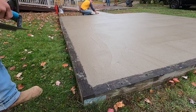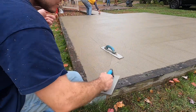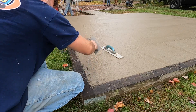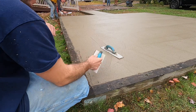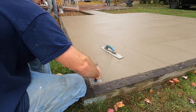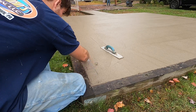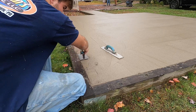Start with the hard part, the corner. If you ever have stuff on your edges, cut it away — it's going to bother your brush if you're doing a broom finish. So get that all scraped off. I cut it into the edge here, so you cut down and walk it. I'm a little quicker but I'm just trying to show you what you're doing if you're trying to learn. Walk it, cut it. Notice how I'm tipping up and pulling back.